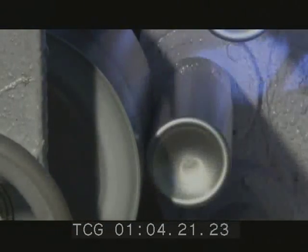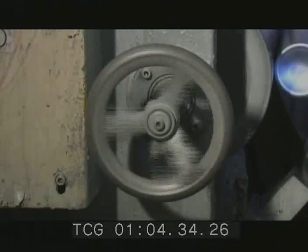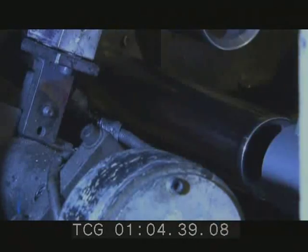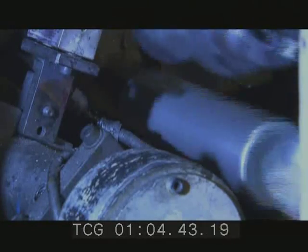And then the outsides of the cans are decorated with colorful logos that are printed directly onto the aluminum with rotating drums that are coated in ink. First, the bottle cans get a base coat of gray ink that sticks to metal like most ink sticks to paper. Then, the cans travel through a lithograph machine that prints the cans with a 6-color design, one color at a time.